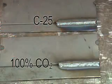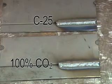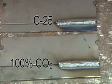If you want to spend a little bit more money and reduce the spatter, and maybe a little less burn-through on thin materials, going to a C25 mix — which is 75% argon, 25% CO2 — might be beneficial to you.